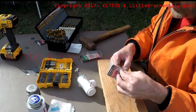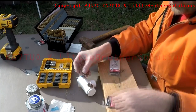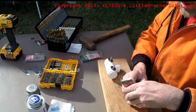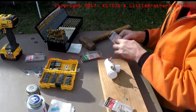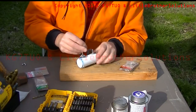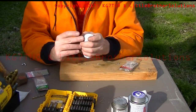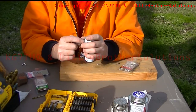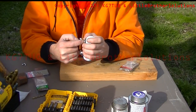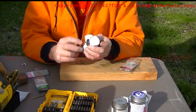Last one on here to have this piece complete, until you get the cable ready. It is two flat washers on each bolt — one, two, one, two. Two split lock washers, and two wing nuts. When you go to put this together, the elements will go sandwiched between the two washers. The ring connector from the feed line will go under the lock washer, split washer, and over the flat washer. Then spin the wing nut down and your antenna connection elements will be complete.